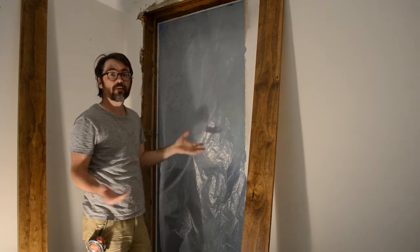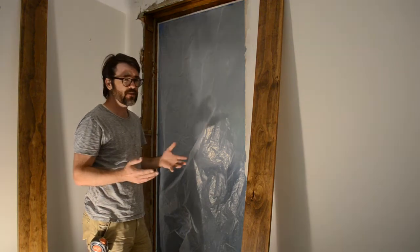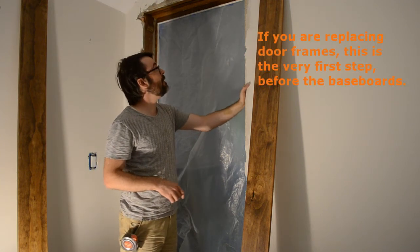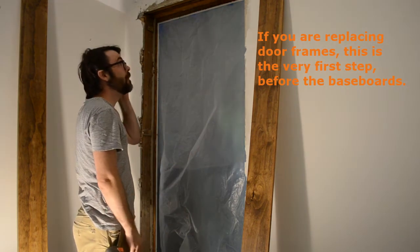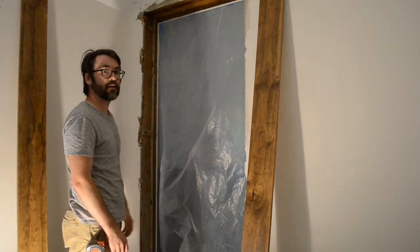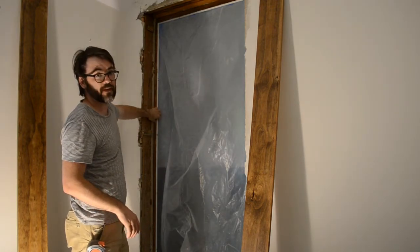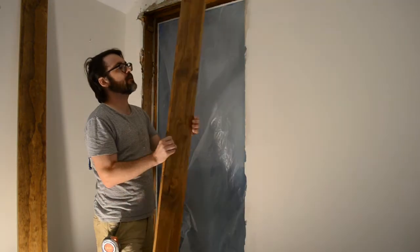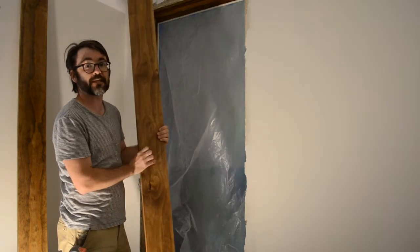If you have to replace the door frame, we can talk about that now. If you have pre-hung doors you probably don't want to do this. My house is about a hundred years old so everything is the same wood everywhere, so I'm going to replace the frame first — that's the first thing you need to do and then all the trim can go out from there. I tried to leave the original trim on the next room so I don't have a hole in the wall sticking out into my living room. What you're going to want are these six-inch boards, finished on three sides.